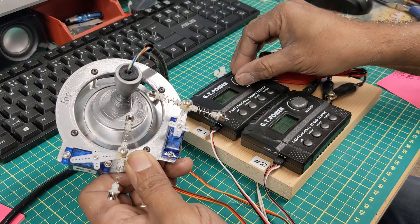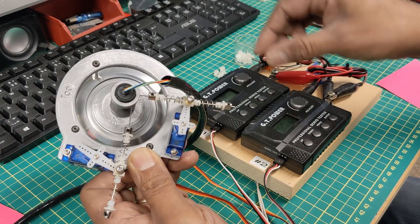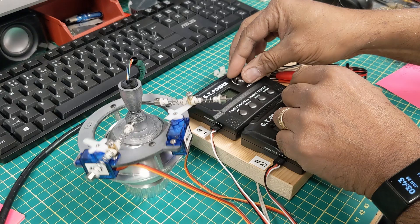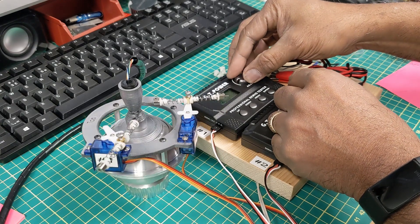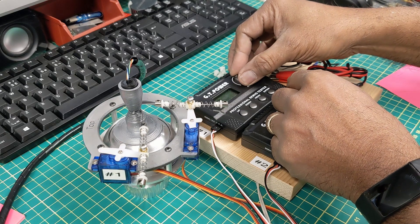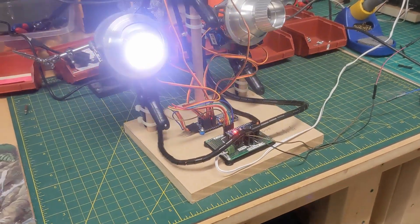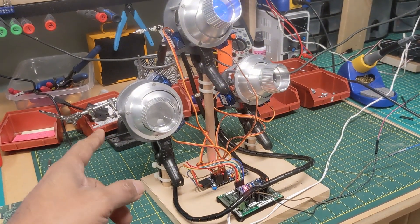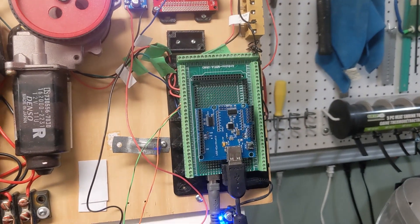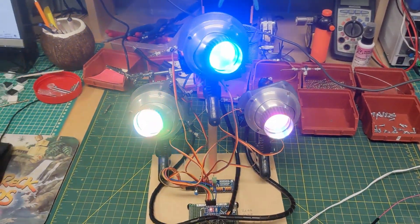I've got my dual servo control here. It still gives you flexibility, but a lot more control over each servo and the tension overall. So I'm just going to redo the other two and then set up my limits. I've got my holoprojector mounted on this temporary stand — I've got the front, the top, and the rear, and they're just functioning right now. I've got them hooked up to my Mega on my old proof-of-concept board, with the wire running down onto these holoprojectors for the serial control.